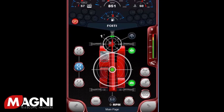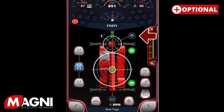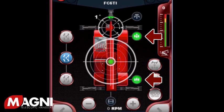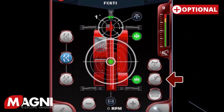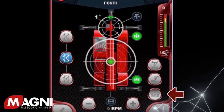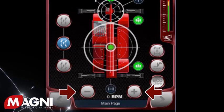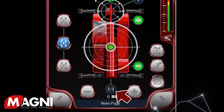To the right side of the machine picture, there is an indicator that is only used when the Nordic package — for extreme cold weather environments — is installed on the machine, which would indicate whether the turret rotation is locked or not. Next, you'll find a circle next to the front and rear tires, which will illuminate green when each of the tires are straight. Working down from the top, you'll find a button that switches from two to four-wheel drive. Below this is the boom damper, whose function is to minimize vibration to the boom and the load when the machine is moving. This should be engaged when driving any distance or at high speed with or without a load. Below is the eco option — when eco mode is engaged, the machine can drive at the maximum speed using only 1800 RPM, which provides increased fuel efficiency. Located below the machine picture are plus and minus buttons used to increase or decrease the RPMs during warm-up. Lastly, in the center is the chassis tilt lock for the rear axle, which is an automatic function and acts as an indicator only.